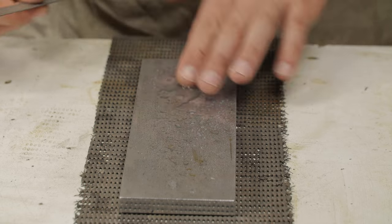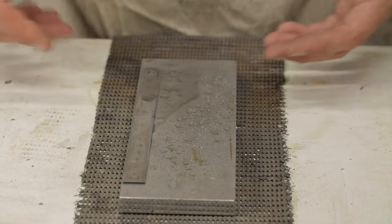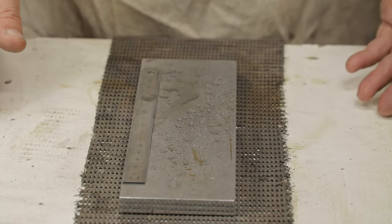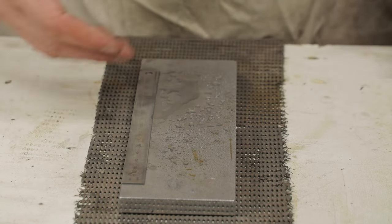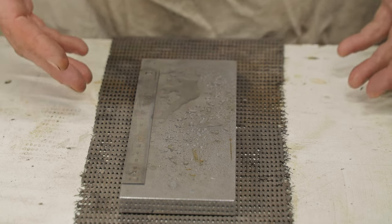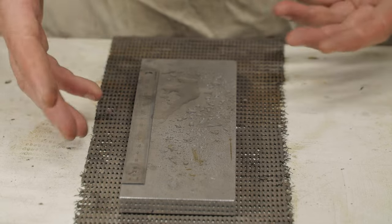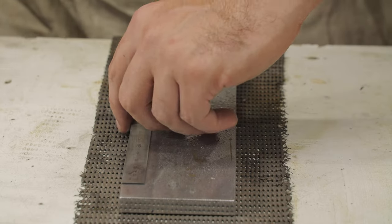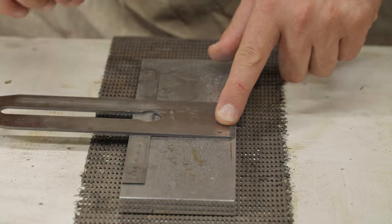So what you want to do is wet your stone down and sit the ruler on your side here, or if you're left-handed on this side, depending on how you flatten the back of your blade. Wetting the stone will actually help to hold this ruler in place while you're moving back and forwards. You probably want a ruler that you're not going to be using much because the indentations and things like that do get rubbed off by moving your plane blade back and forwards.